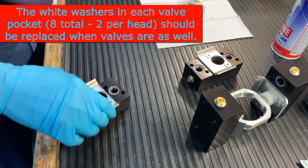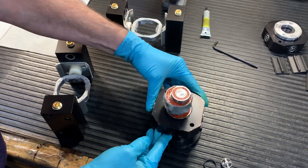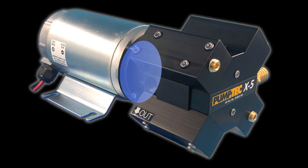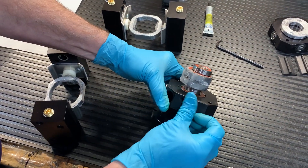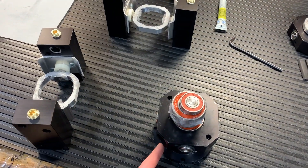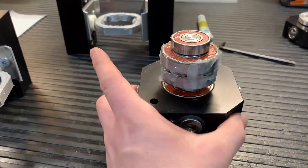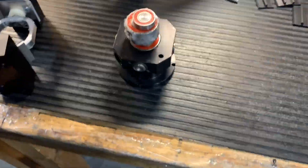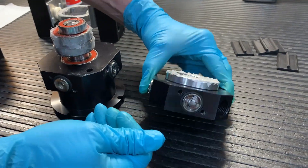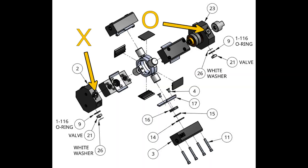The next item is to make sure that our valves and seals are replaced where the adapter plate attaches to the X-Pump on that manifold. We have all of our valves showing an O, and around each valve is an O-ring. So there will be four rings and four valves. We want to make sure that each one is securely placed in, as shown as I rotate it here — four O's and four O-rings. The other manifold, we will put in four X's and four O-rings. A total of eight O-rings and eight valves.